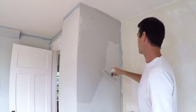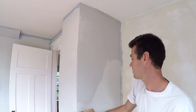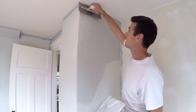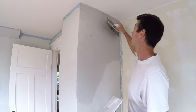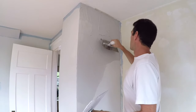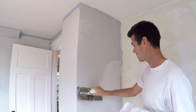I almost put too much glue in that mix. There's our high spot right there. The other thing that this does is it makes the mud really strong when it dries. So get it flattened out as best you can — it doesn't have to be perfect at this coat; you can put another one on, which I will be. I'm messing about because there's this giant bulge right here. I'm just going to have to leave it — smooth that out, smooth that out. I can flatten this down when it kicks off.